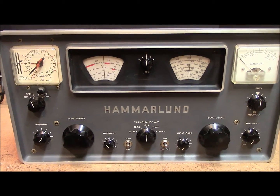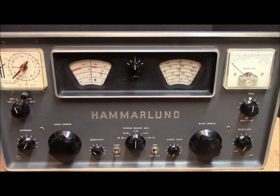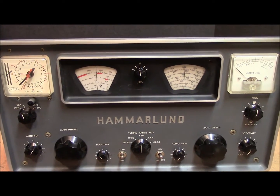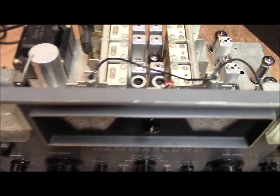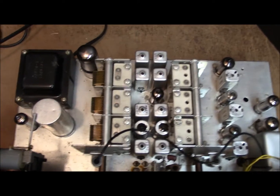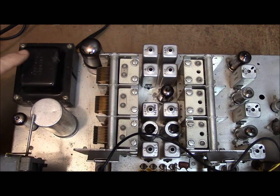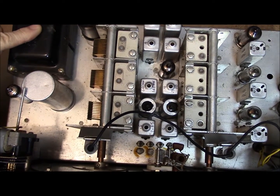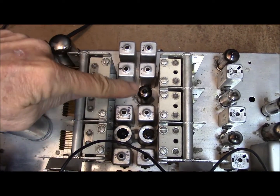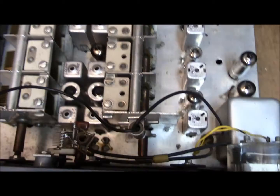This particular radio is a model 100A. I got it off of eBay and it basically is just the way that it came in — I haven't changed anything on it. It still has the clock, and if you look inside you're going to see that it has 10 tubes, all the original stuff. It has the big electrolytic capacitor, the large power transformer, and look at the big tuning coil, tuning capacitors, a lot of tuning coils. It also has three IF cans — these are 455 kc.